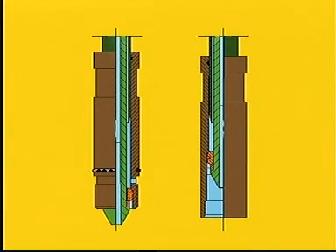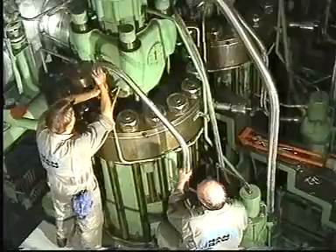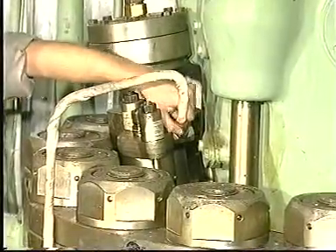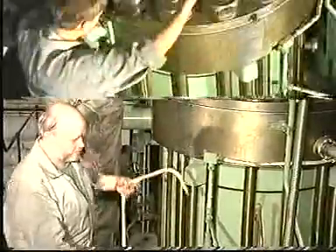The fuel oil high-pressure pipes may also be of the double pipe design — see instruction book procedure numbers 901 and 909. Remove the high-pressure pipe, taking care not to damage the high-pressure pipe seatings. Disconnect the return oil pipe from the fuel valve. Mount protective plastic plugs in or on all high-pressure seatings.